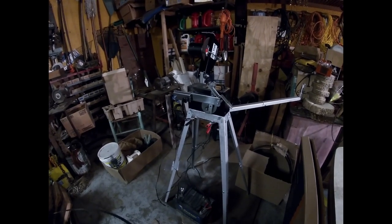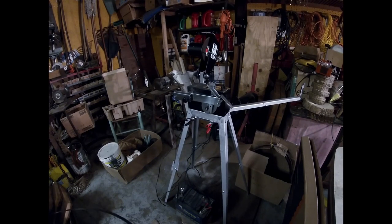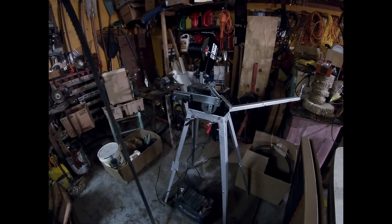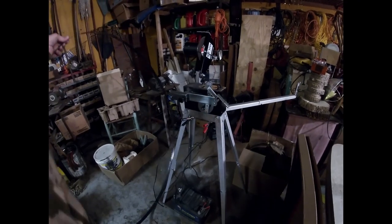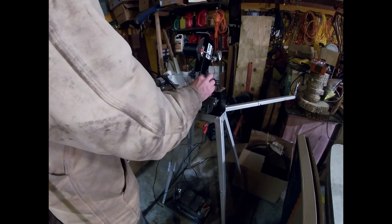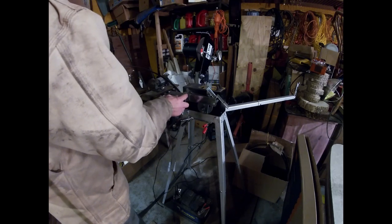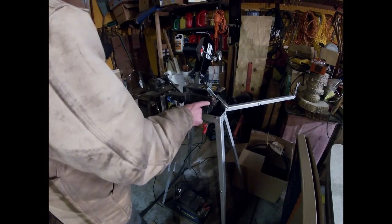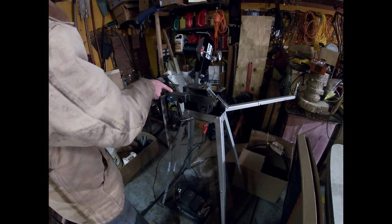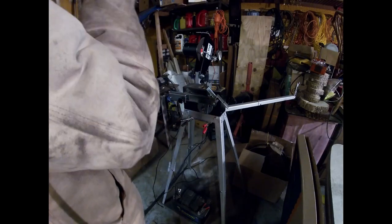It's been sharpened twice on this blade. Double hard blade from Woodmiser. The advancing arm should be set almost correctly. You loosen this, pull this blade back, pull this box back. Your blade is going to ride behind this washer and behind the washer that's back here, and this is going to pinch your blade just a little bit so it advances slowly.